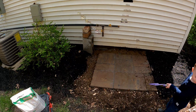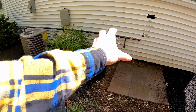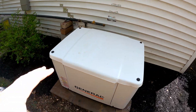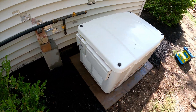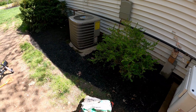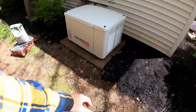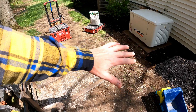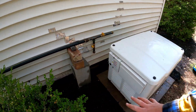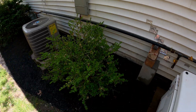Everything is graded and sloping to drain water away from the house — positive drainage all around. I need to be careful not to block a small ventilator opening nearby; I may seal that off due to carbon monoxide concerns with it leading into the crawl space. Here's the generator tentatively set in place — it'll be centered better once we hook up the gas. It looks great on a simple paver pad. It's elevated well above any potential moisture. Also keep in mind that generators typically require 18 inches of clearance around them, and exhaust blowing against nearby boxwoods could really damage the plant material.